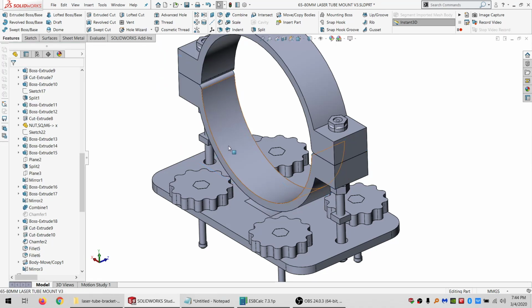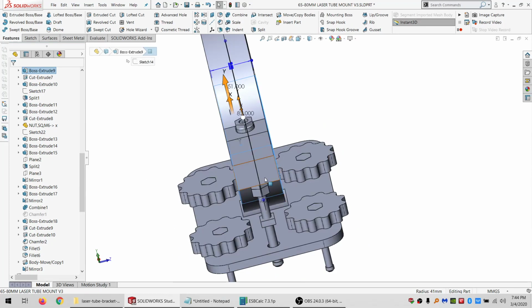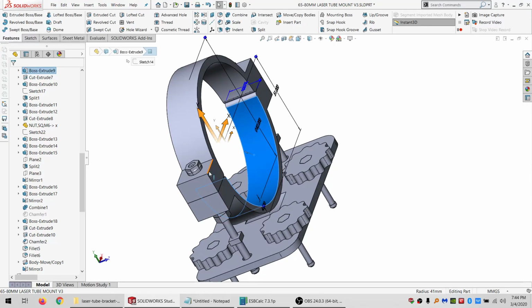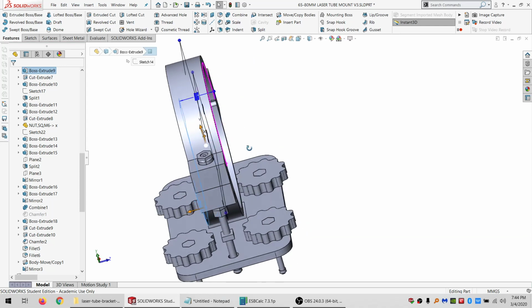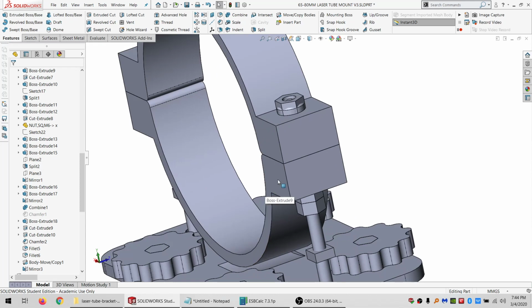So adapters are, well, they're rubber, but they're about 20.25 wide. So I need these to be 20.25 wide, and then on top of that, I'm tempted to put like a lip on them, but at the same time, that's just going to make 3D printing them harder. Suppose I could put the lip only on the one side, like lip here and then a lip here. That might sort of help, maybe. No, I think I'll just let it be.